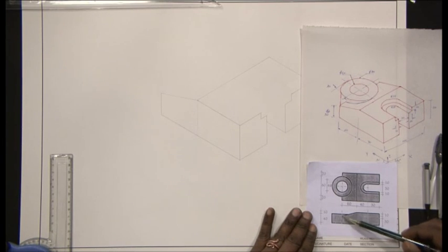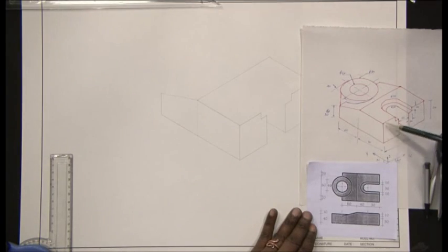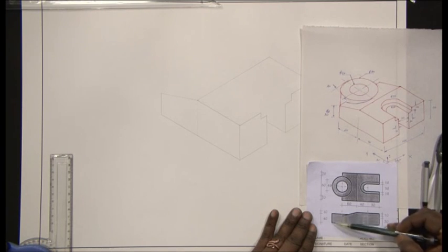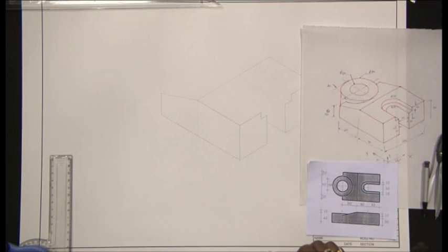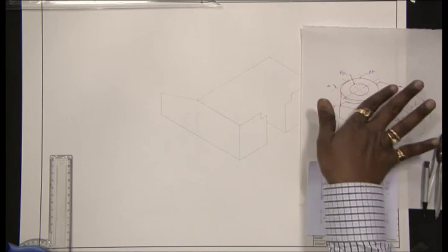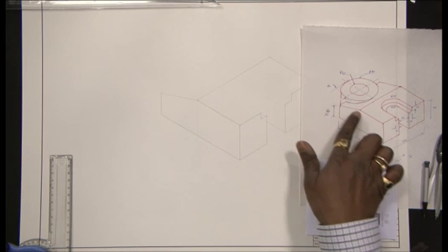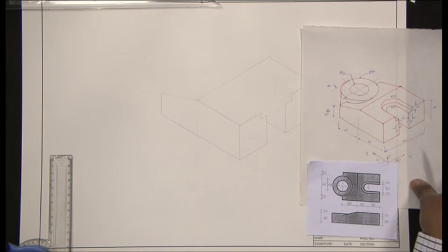because this height is about 30 millimeters, and this height is about 40 millimeters, whereas this height from here to here is about 40 millimeters. So, the plane of this rhombus will definitely be below the plane of this feature of the object by 10 millimeters. And of course, that plane will be 10 millimeters above this plane or this height of the object. So, I need to be a little careful and I need to draw this accurately.